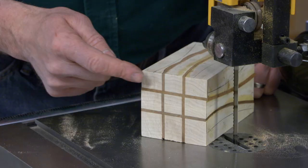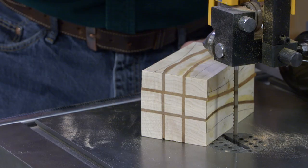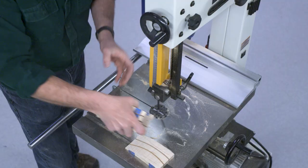As you can see, I have four contrasting pieces of wood glued into my block. Our job now is to go ahead and cut the profiles of our candlestick. I'm going to do that on one side first, then I'll take these off-cuts, tape them in place, and then I'll be able to flip my block — it'll be fully supported and I'll have profile lines on the other side.